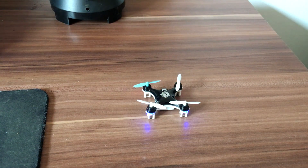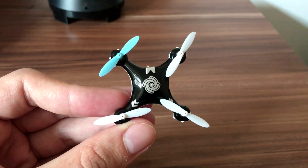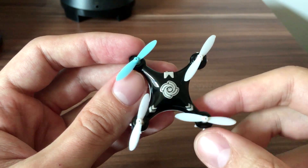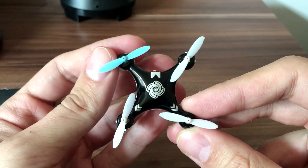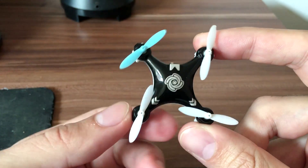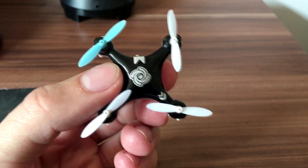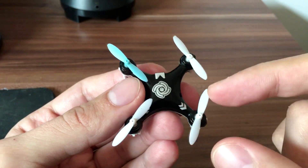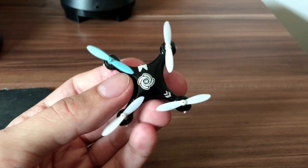As you can see, I have this motor here faulty. Before we start, I need to explain a few things. With the power button on top, the propellers are not all the same. The top left propeller is a B propeller, the top right is an A propeller, the bottom left is an A propeller, and the bottom right is a B propeller. When doing repairs, it's important to know where each propeller is supposed to go — if you put a propeller in the wrong location the quadcopter won't be able to fly.